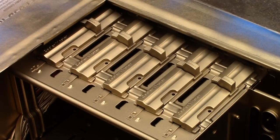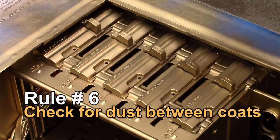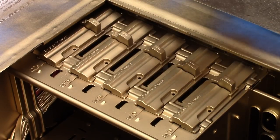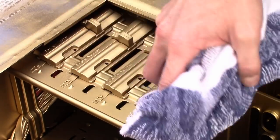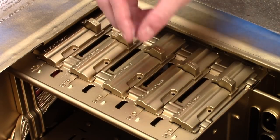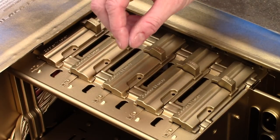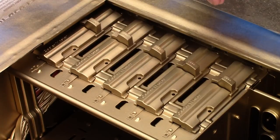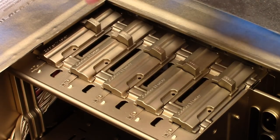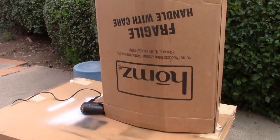The next rule of thumb is that between coats, once you make sure that coat is nice and dry — you've given it a solid 10 to 15 minutes — it's okay to take your lint-free cloth and go over your project before the next coat of paint. That way you can make sure there's no dust on the paint before you put another layer on. Once a piece of dust is trapped in there and you put another layer of paint on it, you're never getting it back — it'll get worse and worse with each subsequent coat. So this is a great opportunity to dust your paint off before the next coat.